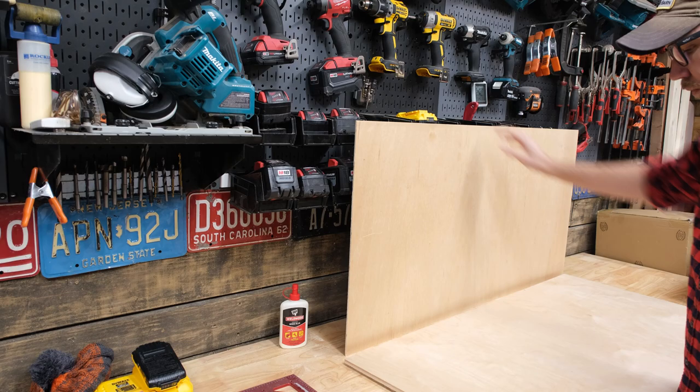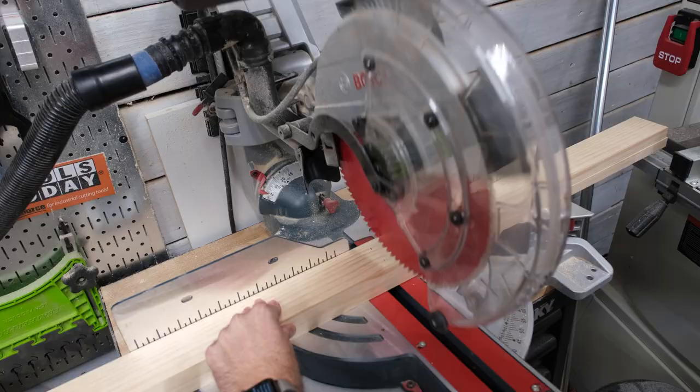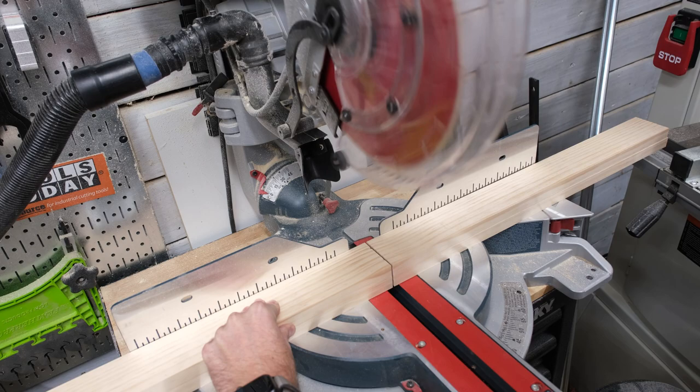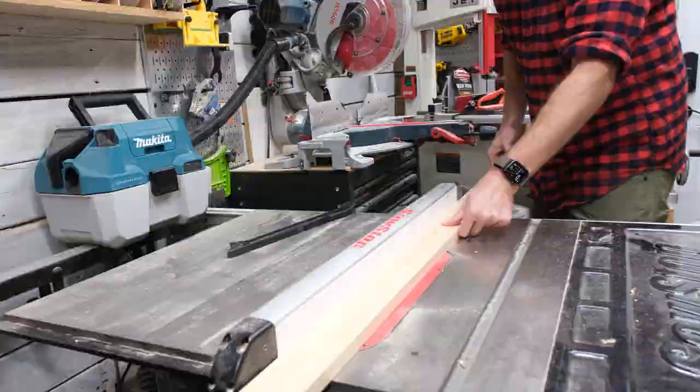This entire project is anchored on a sheet of plywood that is 24 by 48 inches by half inch thick. I'm also using these panels that are blackboard and whiteboard — those are about eighth inch thick. I'm going to cut down these pieces of one by four that are going to be my frame and rip them down to 48 inches. I'm going to fire up a dado here — I'm cutting a groove, passing it through once, flipping it over and passing it again, because my cut is a little bit more than three quarter of an inch thick.